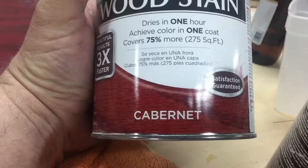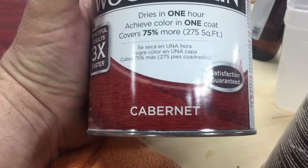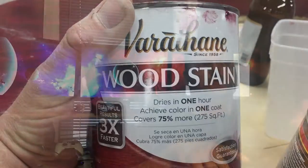The Cabernet wood stain is a triple-thick stain that I used — I only had one coat on there, which is probably why I sanded through on a couple spots. I had originally bought stuff to do shellac as the top coat, then put the stain on and realized after the fact that it was not compatible with shellac. So I was rather frustrated with myself, and I ended up going the all-poly route, which once I figured out how to do it came out pretty nice.